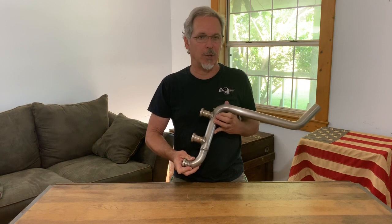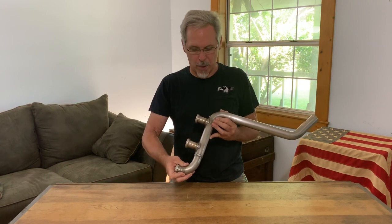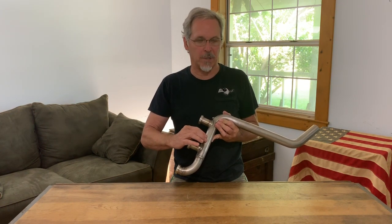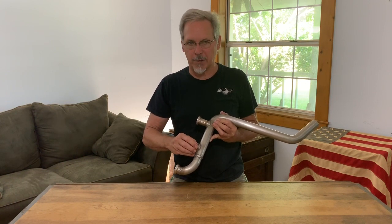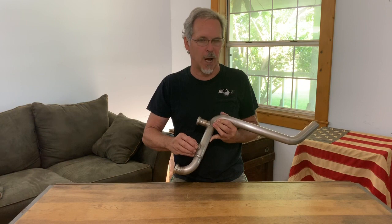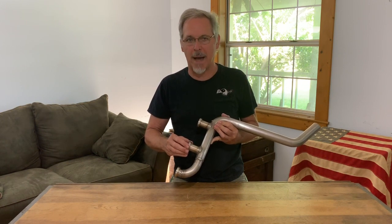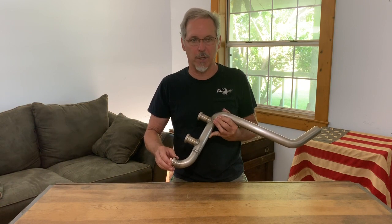You should not use any form of mild steel in an aircraft exhaust system — it's just not durable enough. Stainless steel 304 subcomponents are manufactured on CNC equipment, welded in our own fixtures by my own hand here in the shop. The rod that we use is 308L and they are back purged 100%, producing a very, very durable exhaust system.